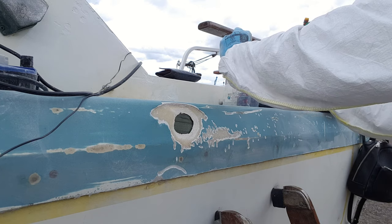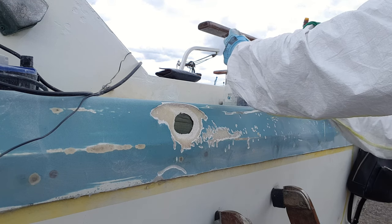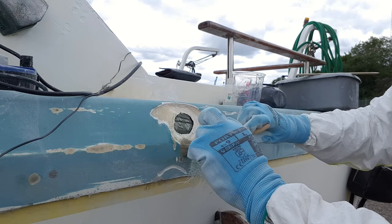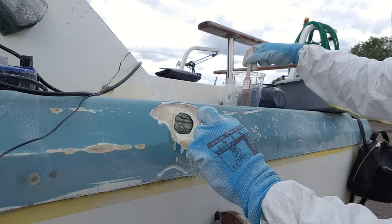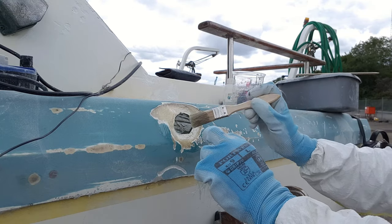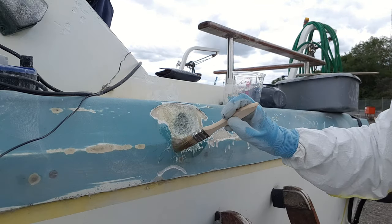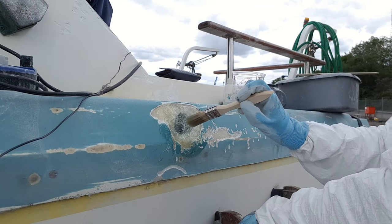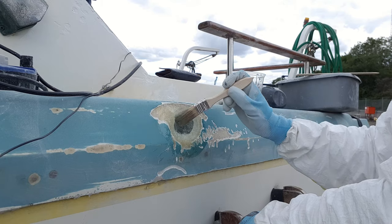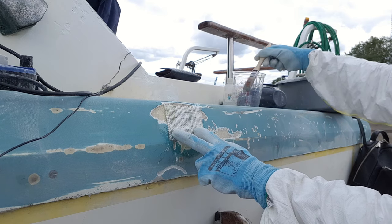So wifey's just saturating and wetting out the first bit of chop. Then it would just be painting raw resin onto the outside of the hole. But you need to paint the outside of the hole first - key it in. And you're safe to go onto the cardboard because it's got the PVA release agent on. So now the choppy goes on. Beautiful - the line's perfect, absolutely fine.